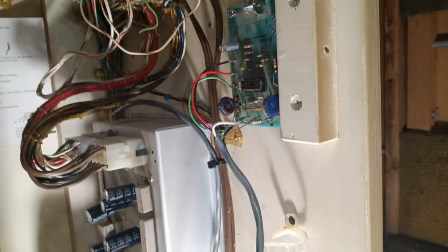At the end of last video we found out that the piano signal was going straight into distortion, which meant the signal was simply way too strong for the input circuit of the little Devtronics preamp. So we had to drop a resistor in there to knock that signal down.